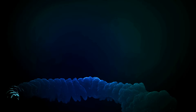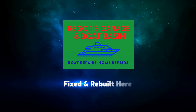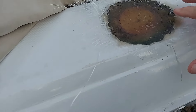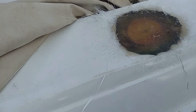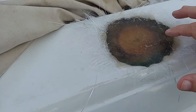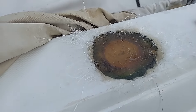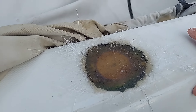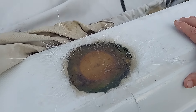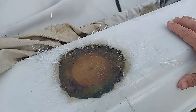If you do, please like and subscribe. I continue to fill up the holes in the gunnel here. I added some fiberglass — I just did this, it's just a little sticky. It's still a slight depression. Probably tomorrow I'll add another two layers of chop strand mat so I can grind it down.